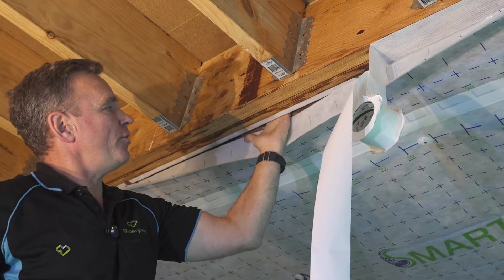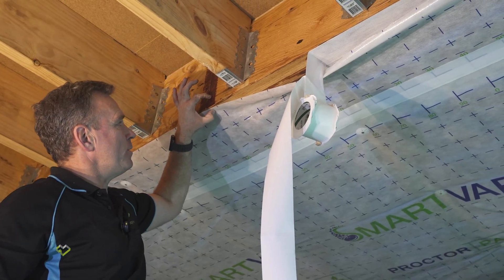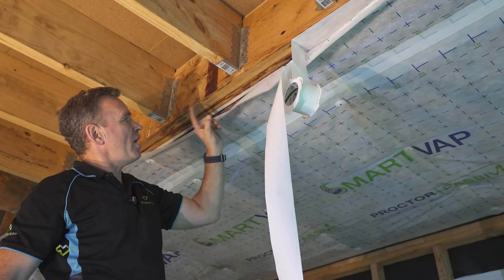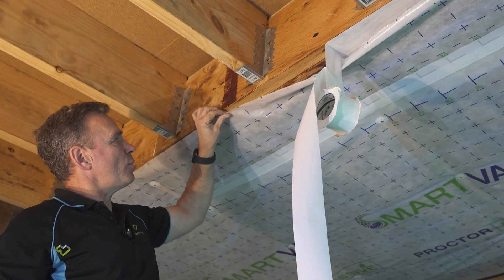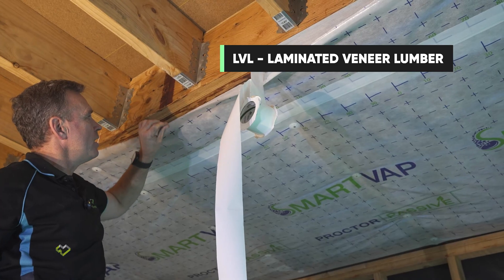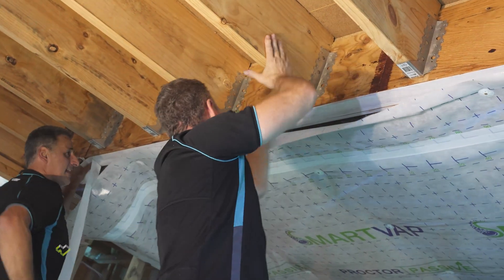You can see the external air barrier has come down to the face of this LVL, and we've got the internal air barrier here. We want to tape it to the back side of this LVL to support this air barrier, but there's actually a gap between these two LVLs. We've taped to this side and we're thinking we need to tape off this joint to make it continuous so that we don't get any leakage across the top of this LVL from the front side. We're thinking about the little things to make sure we're covering all points of potential leakage.